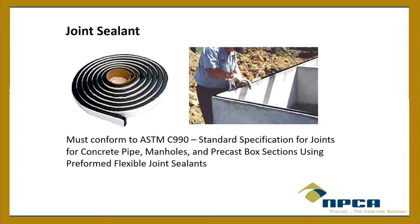Now, when you put the sealant down, avoid joining them at the corners. Avoid joining them at the corners. Because at some point you're going to have to join two together, and if you could knead those two pieces together, that's great. But bring that one about a foot around the corner and then knead it there. If you bring it in the corner, you just increased the risk of a leak. That sealant, its positioning and the way it's put together, it's not complicated. But that extra care can mean such a difference for that homeowner and for the maintenance provider. So come around that corner.